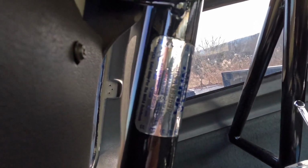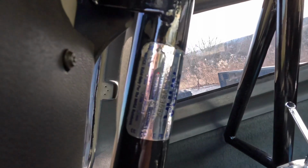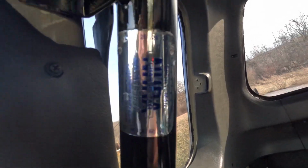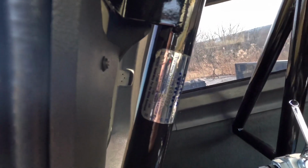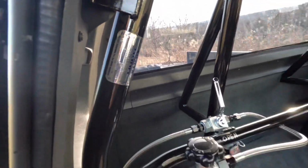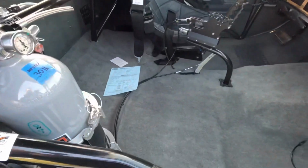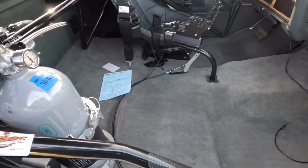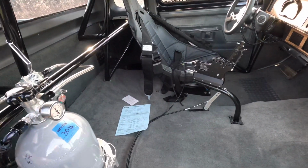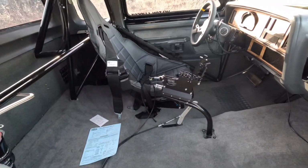And if there's a certain weight limit that you have to be for the faster certifications, they'll punch that out. But as you can see here, mine is just an 850 cert cage, so I'm good to 535, and I won't have to get this done again until February of 2026. So not too much goes into the certification on one of these, but all of the things that I did mention are very important, because if any of that is wrong, they will fail you.